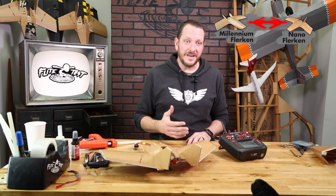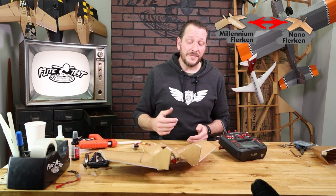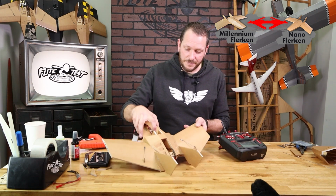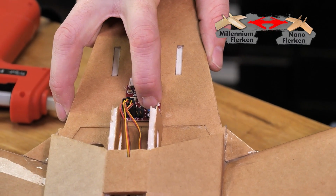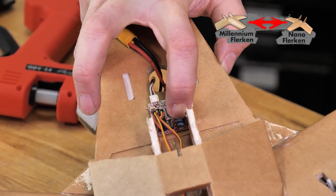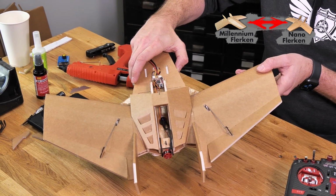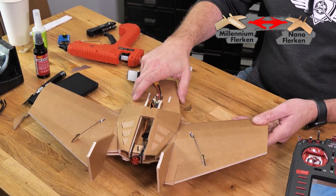There's one last thing that we're going to do, and it's really useful whether you're a new pilot or if you want to fly FPV and have the plane automatically level out just to enjoy the moment a little bit more, and that's called level assist mode. To enter into level assist mode, we're going to hold down on the bind button for 6 seconds while we're in quick set mode. You're going to see the light change. There's the blue. We'll let go of it. You'll see 2 pulses, and we're now in level assist mode.